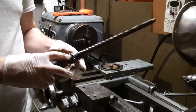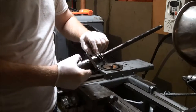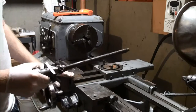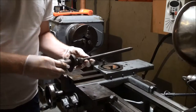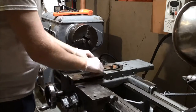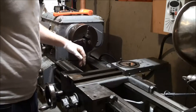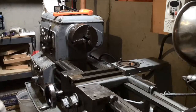So the interesting thing, probably common on more high-end lathes, or more automated lathes, let me use that word, is the gearing. And so the gearing in here rides along another set of gears in the apron. So you have the option of moving forward and aft on the carriage automatically. From there, this piece would usually be taken off the back. Problem with that, the reason I can't do it, lathe too close to the wall. So this is where things stop going as fast, and we'll start making more progress, and I'll talk through more things.